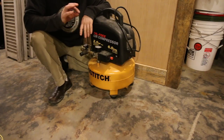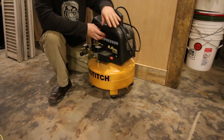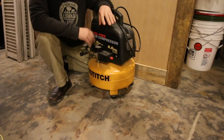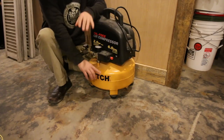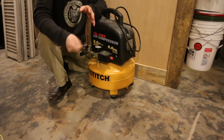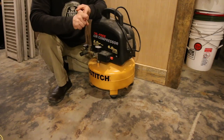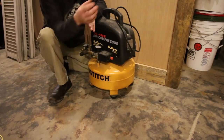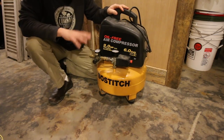Let's talk air compressors. I'm not going to get into all the different styles out there — just air compressors in general and the one we have. The reason we have the pancake style is it came with the nail guns at a great price, and it's portable. Just like every tool, every air compressor does its own job. A small air compressor like this is handy because it's portable — it'll run nail guns, put air in your tires, or power a blow gun to blow off debris.